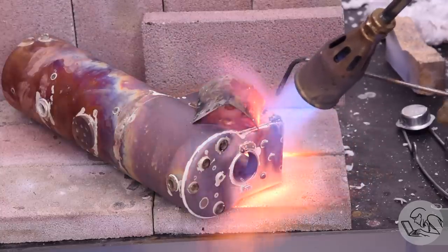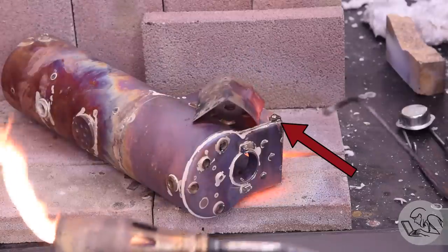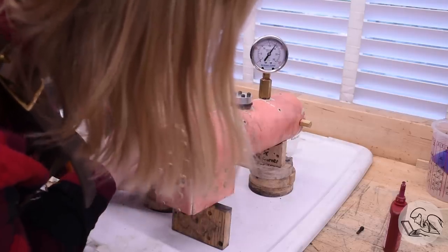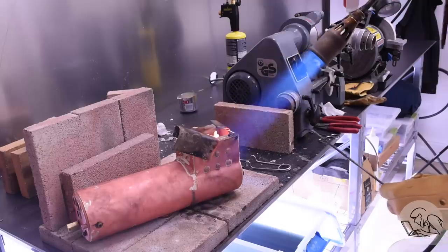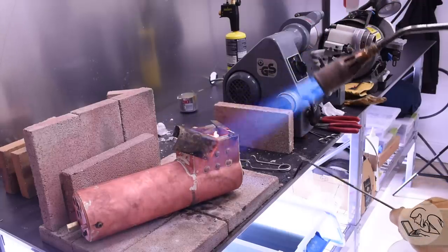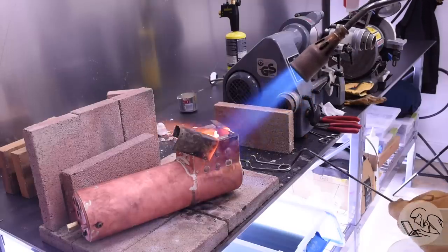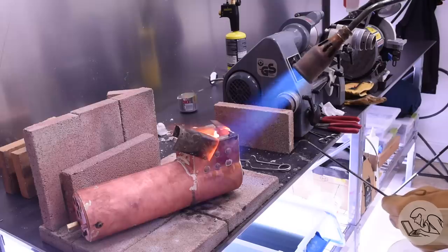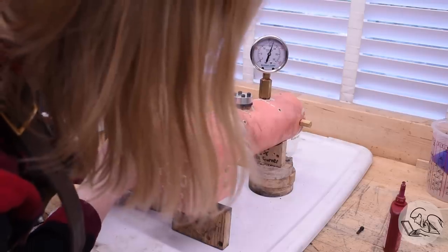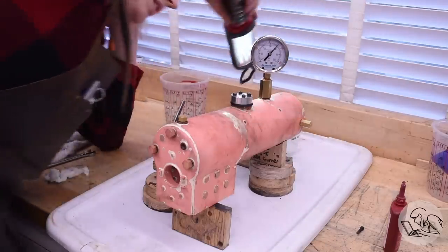This was going wrong but I didn't notice at the time - on the video you can see solder flowing in the joint below that repair. I pumped back up to 200 PSI after that repair and I had damaged the foundation ring in two places repairing that little weeping corner. Two places. So I set it up again and repaired those two corners of the foundation ring once again. This is always the fear with a boiler: you'll damage old joints and it turns into two steps back, one step forward. Back up to 200 PSI - the foundation ring seems to be holding.